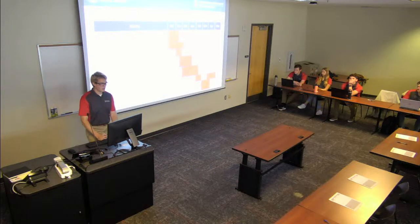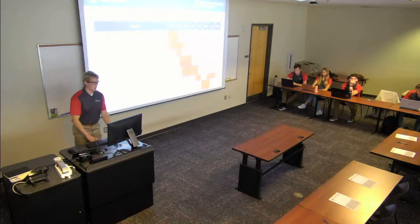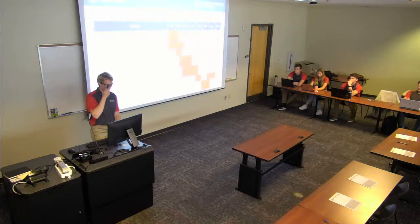Later on, after we've done all our testing for our nose cone and transition piece, that's when we want to verify our computational results with our wind tunnel testing and hand calculations. After we've done that, we've made our geometry changes. We're going to work on determining drag coefficients for the rocket at all flight regimes so that we can also develop accurate altitude calculations. And then after we have our test flight, we'll use that to go back and verify our altitude calculations.